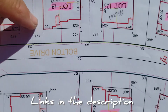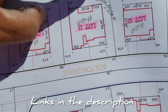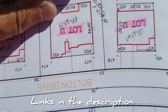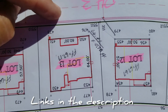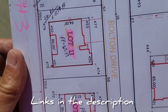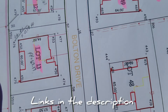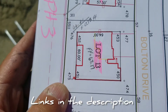You can see that little circle is our offset point — five foot offset to the building corner. Over here, point 477 is a five foot offset to this building line protruding out — that's the building envelope, the envelope of the whole building. Our contract calls for four five-foot offsets. Sometimes what's in the contract can be negotiated; we've worked jobs where they only wanted two offsets, but it became very hard for the crew to square up the building on just two offsets.